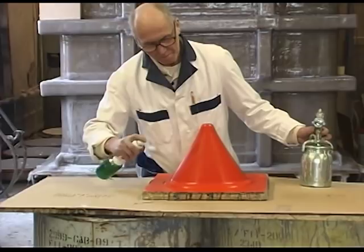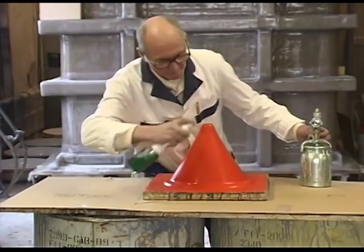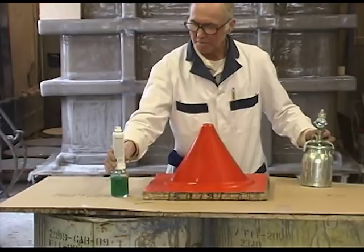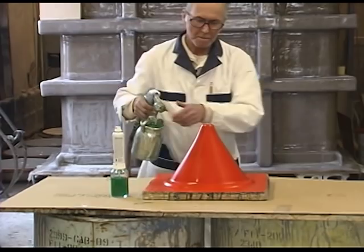These are quite handy for small parts, which this little part certainly fits into the category. With a boat mold, you certainly wouldn't use something this small. But what we'd like to show you is that Bernie's going to do half the mold here, and with PVA, you want to get a nice little wet coat on. You're going to see the mold a little wet. And then on the other hand, we're going to show you using a commercial spray gun. We're just going to dust the mold or spray the mold with that. And he'll do the other half of the mold.